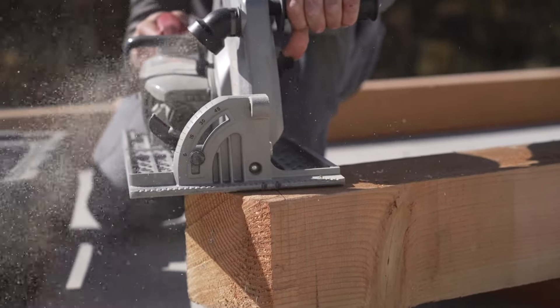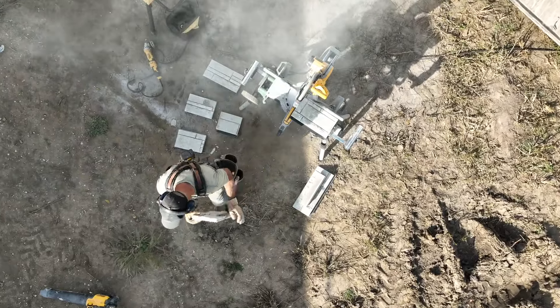This section is about marking your piers for elevation. If you're going to build your walls on the ground, this is something you need to do. If you decide to stand your columns individually, you can do this later. Either way, if you mark your columns before you stand them, all you have to do is line your girts up with those marks and nail them on. This makes you more efficient and more accurate.